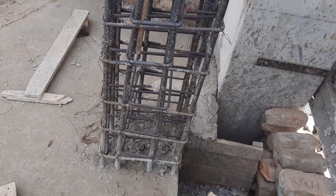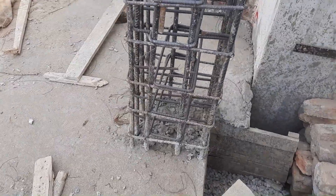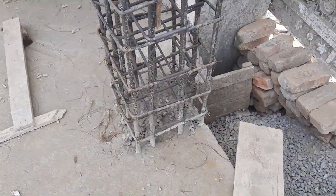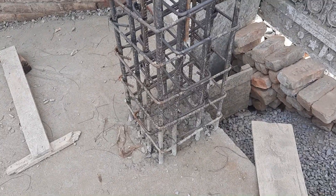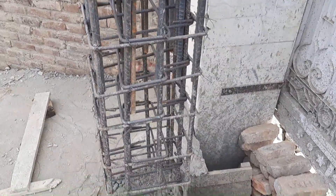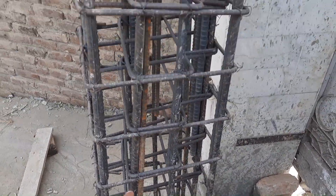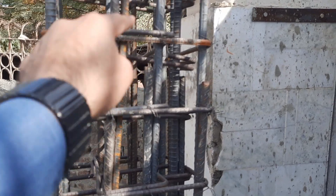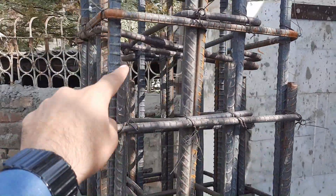This is the corner column. The size is the same — 12 steel rods, diameter 20 mm. Tie diameter is 8 mm with spacing from 100 to 150 mm (4 to 6 inches). Length tie diameter is also 8 mm with the same spacing. The lapping is provided on the correct place and not at the same point — they are staggered from each other.